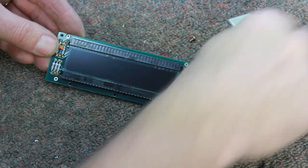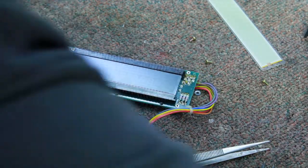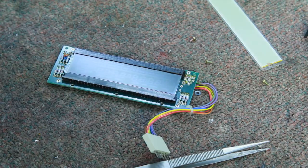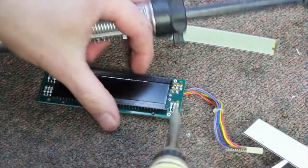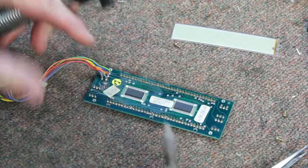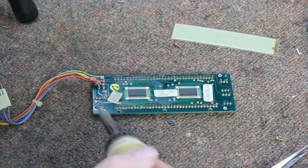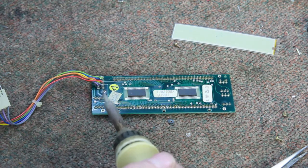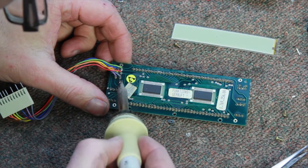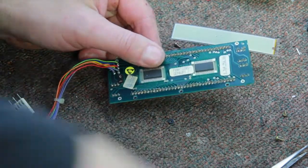And that's the old lamp — it's going to look like that: silver on the back, and the other way in front. Now you take your solder sucker. You want to flip this thing over after you remove the old one, and use a solder sucker to pull out the leads from the other lamp. You should suck them right out. Make sure you clean them up so you can see a pretty large opening in front of the holes.